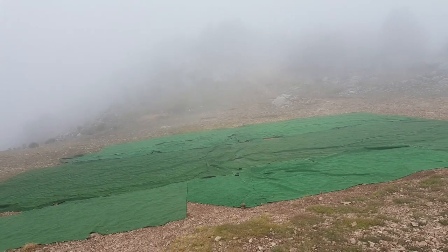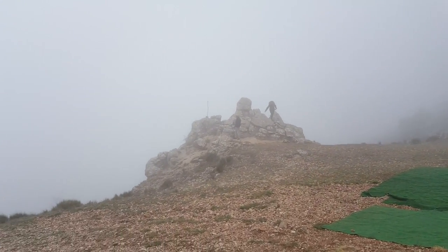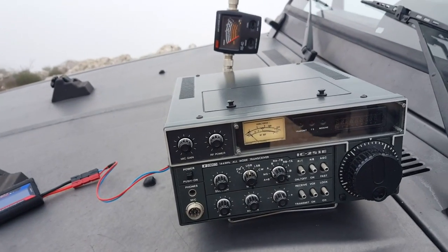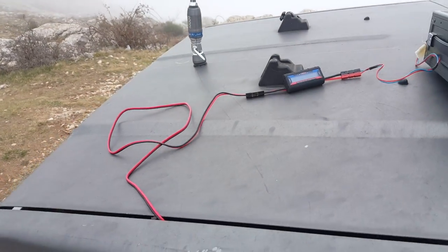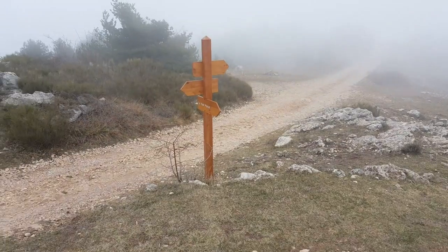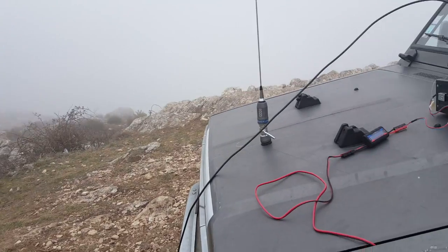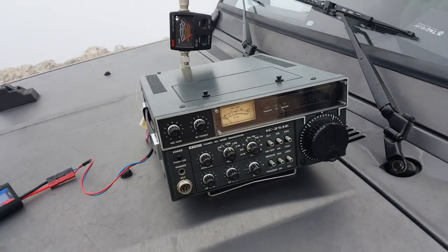They lay their wings on those carpets and just jump off. Of course we can't see anything today. I have the ICOM IC-251E plugged into the car battery, the mast installed, and the antenna attached to a signpost. I think VHF USB and CW are really underused modes — great for prepping because they handle weak signals over long distances, far more efficient than FM. Here we have the Moxon antenna on top of the mast, the ICOM ready to go, just adding a microphone and a key.